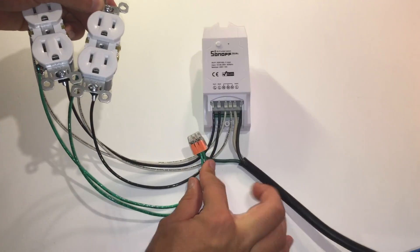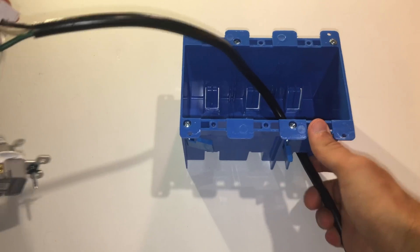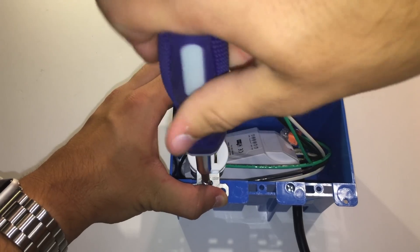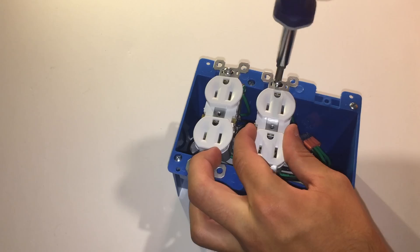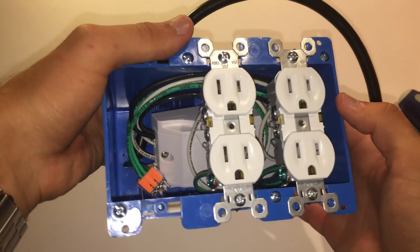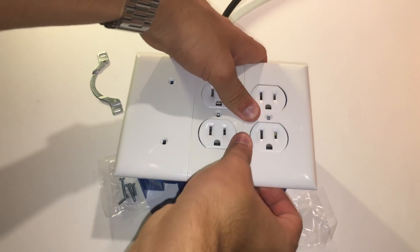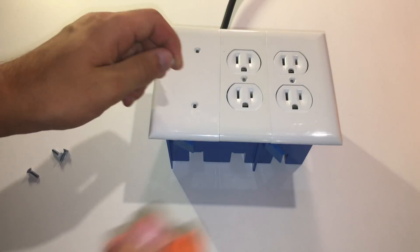All that's left is to tidy everything up. Grab the wire cover for the Sonoff and screw it on using the Phillips screwdriver. Then pull the power cable back out of the enclosure so there's no extra slack inside and the Sonoff sits nicely at the bottom. Take one outlet, twist it along with its wires to shorten and compact them, and slightly screw it into the enclosure. Do the same with the other outlet. Once both are in, align them and tighten their screws. Take the cover plate pieces, assemble them into one big plate, and test fit it over the outlets. My blank plate required a metal riser, so I screwed that into the empty spot. Finally, screw the plate into the enclosure using the white screws that come with the plate.